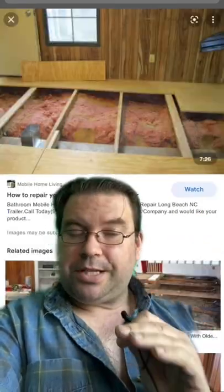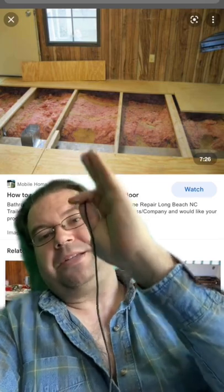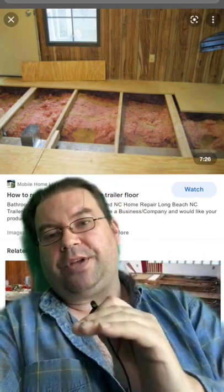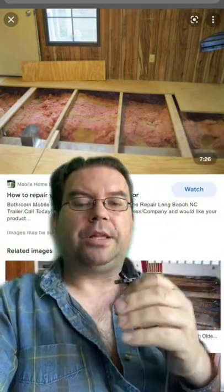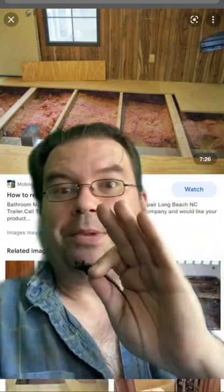So if this was in my house, I would look into adding some extra joists underneath if you can. And when you do, make sure you lay this tank long ways across the joists, so you can spread the load weight over multiple joists. Hope that helps.